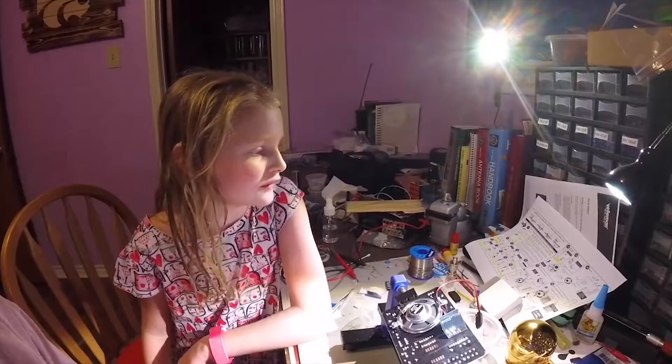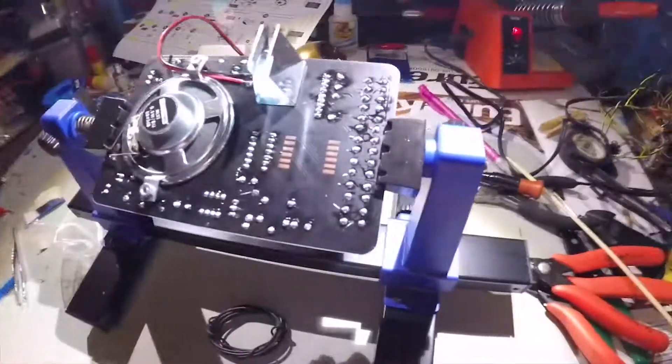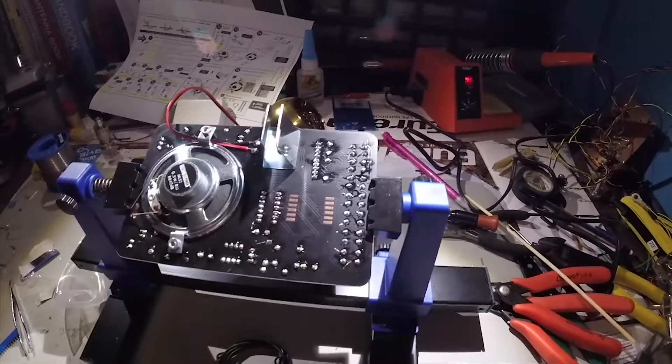Day four. And what are we building? The radio — still. An FM radio? Yeah. We are down to the final step. The actual magic in the whole thing is this little chip full of surface mount stuff. We're going to solder it on here — put some solder on each of these pads, then tack solder it in place using a bamboo skewer to hold it, then wire up the speaker and we should have magic.